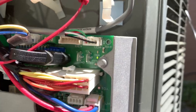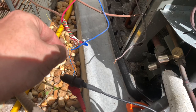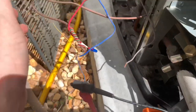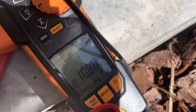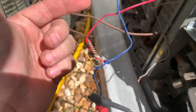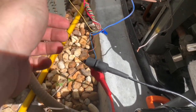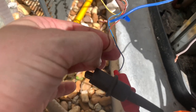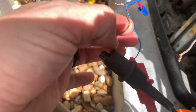As you can see, we have nothing lit up right now, because I have the wires disconnected coming from the indoor unit out to the thermostat wire. You want to have 12 DC volts — as you can see, we have 10 — so we're not getting the proper voltage for this system to communicate back and forth.